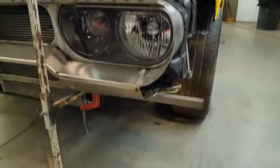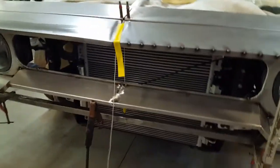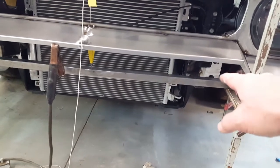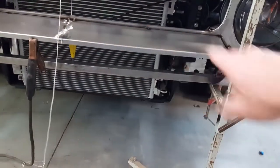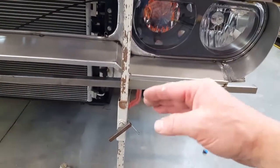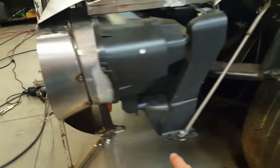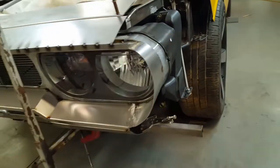What I'm doing right now is trying to establish this lower support for where the bottom of the bumper will roll under. I still haven't tied this in to the car — it just goes below and will get tied back to the end of the frame rail here somehow. This might have to be cut somewhere along to follow this contour, but initially I'm just establishing this roll over here. I'm basing it off the rendering, which showed the bottom of the bumper following through right at about the top of the hub.